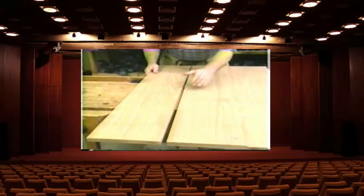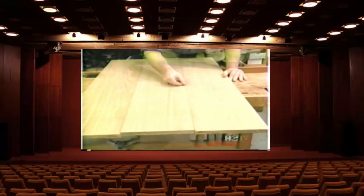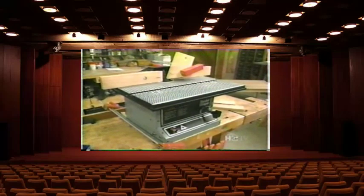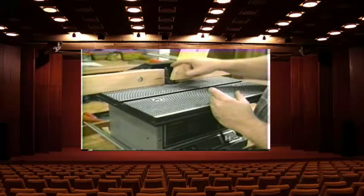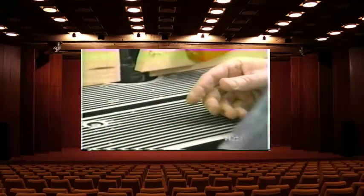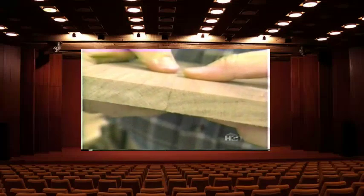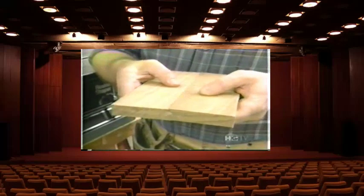These boards, the edges are just as they came from my hardwood outlet. This one fits pretty good, but this one has a little bow in the middle — it doesn't make contact on the end. Even though we're going to show these joints, in order to get a good strong glue bond, these have to fit pretty well. So I'm going to run all the edges through the jointer. If you don't have the room or the budget for a full-size shaper, consider one of these — it's really one step up from a router and a router table. It has a permanently mounted heavy-duty motor and takes router bits like a router table. But there's also an accessory spindle which allows me to use heavy-duty shaper cutters. I've set it up today with a cutter that makes a glue joint, which gives a lot more glue surface than a simple butt joint and prevents the boards from slipping — it's an interlocking joint. I've also installed a featherboard on the router table to hold the wood tight to the surface so it can't cause an uneven joint.